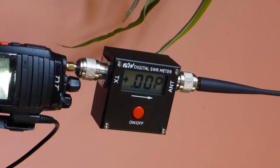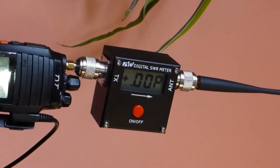That's what we're looking at for how this OEM antenna can handle the power going through it, and the reflected power is the one of interest. It's an acceptable reading at 150, but when you get up to 160 or 170, you're losing about half your power to the reflected wave coming back in terms of the standing wave, which isn't good for reaching very far distances, and it's definitely not good for your radio. Let's now see what can happen if you go over to the tuned antenna.